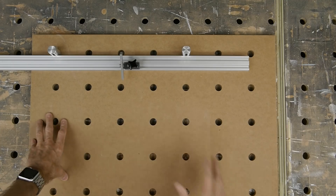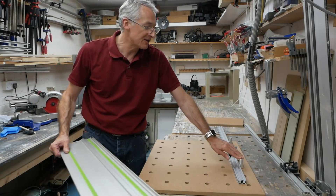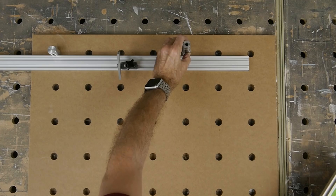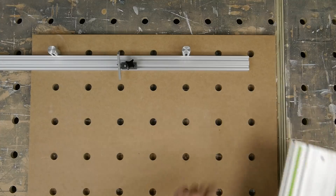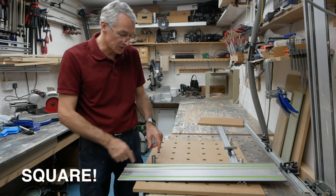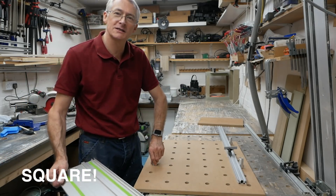It's one of those occasions when you really want the fence to run under the rail to give as much support to the workpiece as possible. If you're using the fence dogs, as I've been recently with an MFT style top, I heartily recommend getting a set of bench dogs from Bench Dogs Co UK as well, because then they'll be the same thickness. There's nothing wrong with using another third-party brand, but you need to figure out if they're the same thickness, because if they're not then you won't get a dead straight cut. You could probably wind some tape around it if you've already got a set, but you must have a dead straight cut, otherwise this is all a bit pointless.